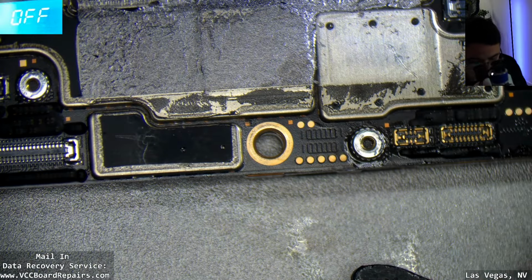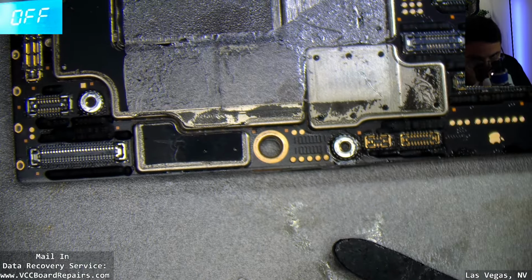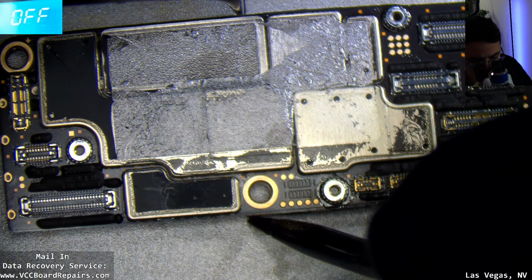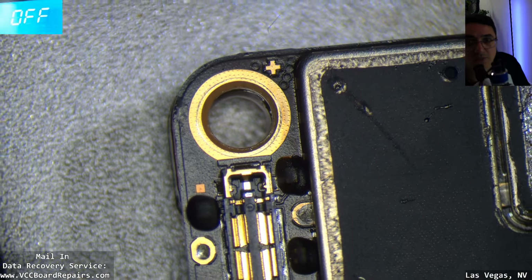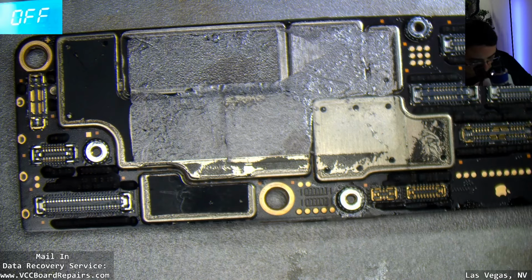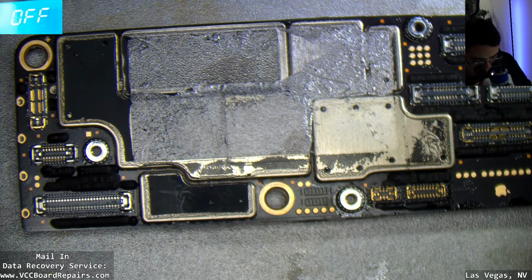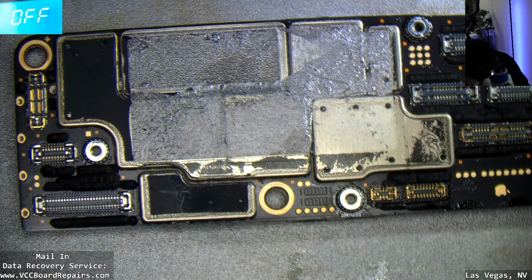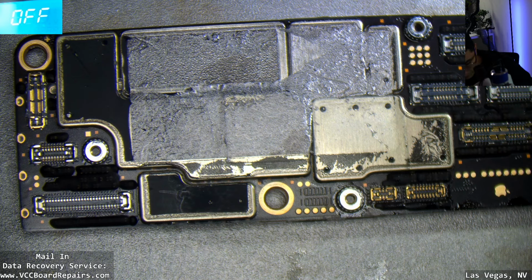So I got to bump my holes there. I shifted it a little bit, and then that's still good. Even this side is pretty good. It's pretty close, so I don't want to keep messing with it and then ruin it. So now we're gonna go back to, let's do 200 heat on the heat plate and see if that will melt the solder. If not, we'll go a little bit higher. And since it's aligned, we don't have to really touch it right now. We just gotta let it heat and kind of just let it fall straight down.